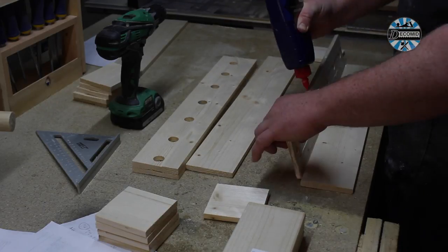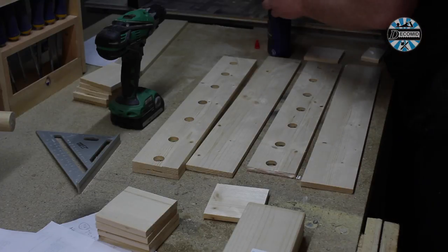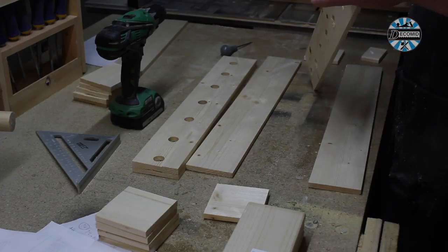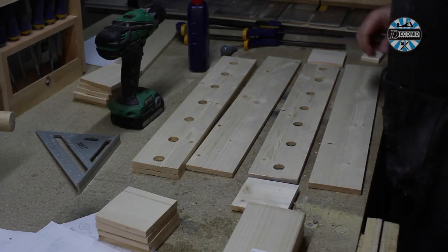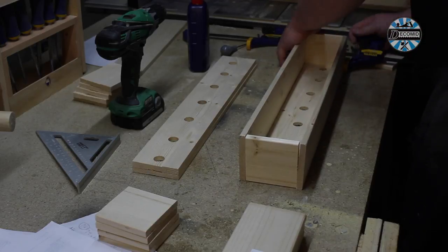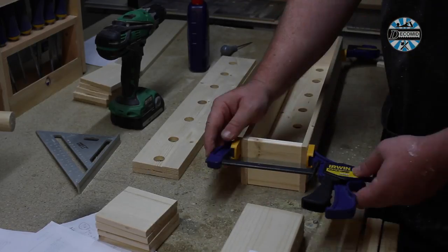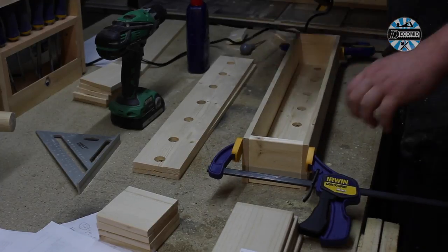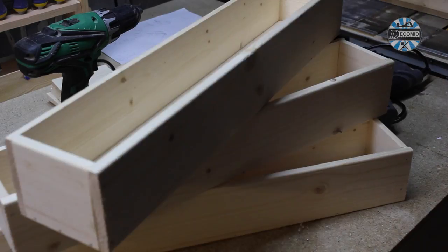The cut parts with the trays now need gluing up. I thought of cutting rebates and assembling that way, but since these joints are prone to damage if the wood swells and since this is going to live outside, instead I chose the expedient route of waterproof glue and brad nails. This was rather fiddlier than anticipated and I needed a third hand or two. Clamps came to the rescue. Very quickly these were all assembled.